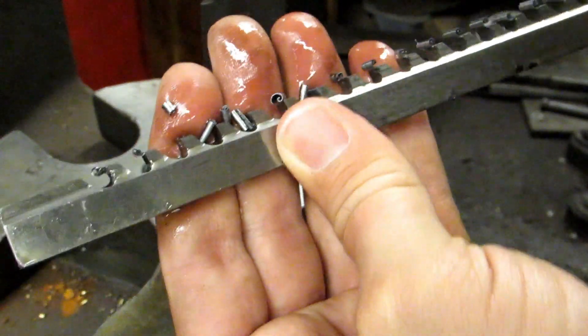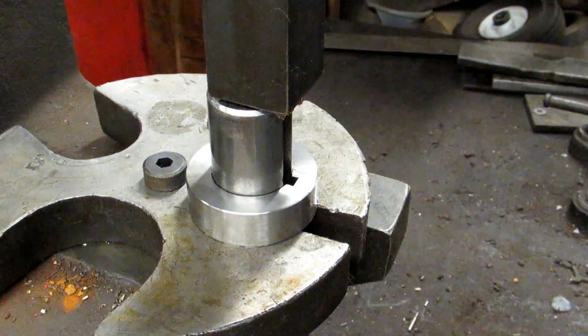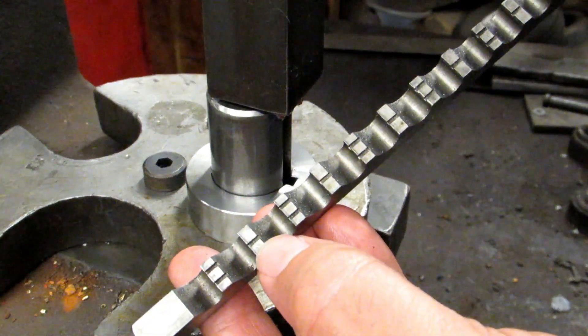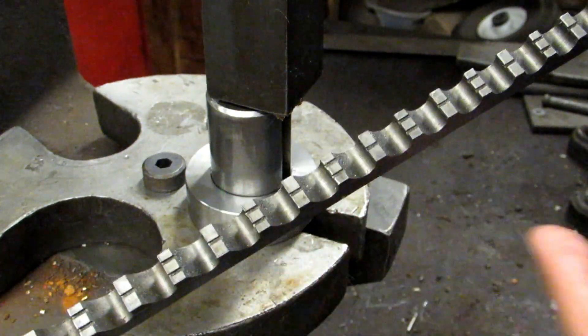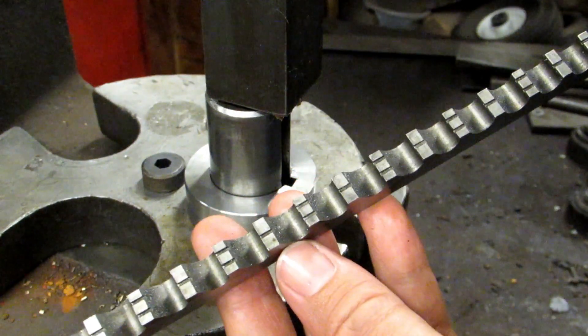So you can see that each tooth took off just a tiny chip, maybe four or five thousandths. The larger size broaches have these little cuts on the teeth that help to stagger the chip. It kind of acts like a chip breaker so that each tooth isn't removing as much material, and the one behind it will go ahead and clear out what the other one didn't get.